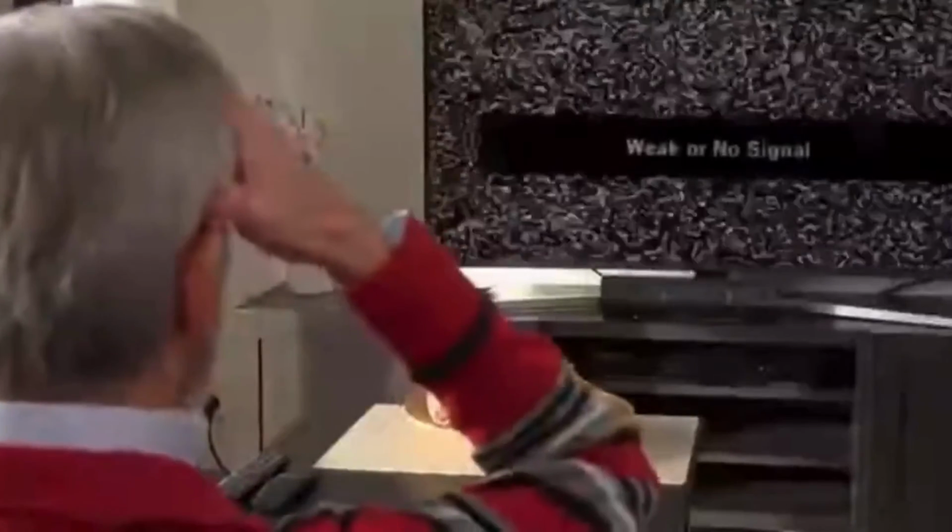Next, the indoor antenna is susceptible to interference. This could be because, when transmitting the signal frequency, the walls and the ceilings of the house do not permit the signal to go to the receiver point. To overcome it, place the antenna as high as possible or move it to the window to avoid the material used in wall construction that interferes with the signal.